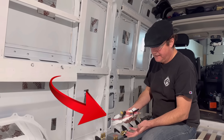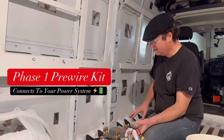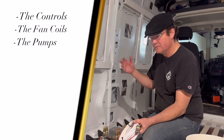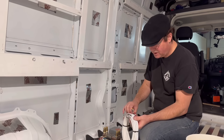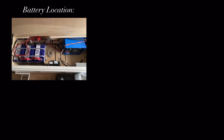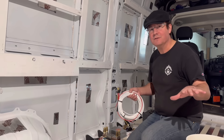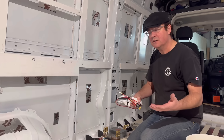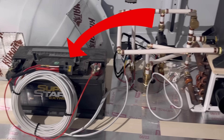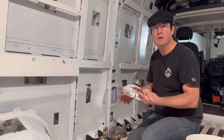This is what we call our Phase 1 pre-wire kit. This is the system power that powers the whole heating system — that includes all the parts that control the fan coil, the pumps, the heater outside, and the boiler controls. It's set up as a two-wire system that runs from your battery location to your mechanicals location. The way it ships is already pre-terminated with two terminals, and it's already pre-fused and protected for everything in the system. We can connect it to a shop battery and turn on the system right from here.